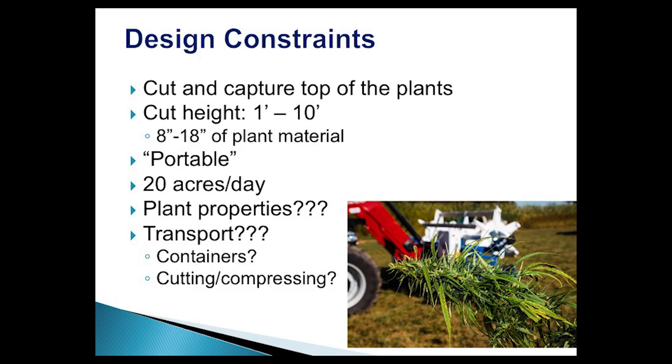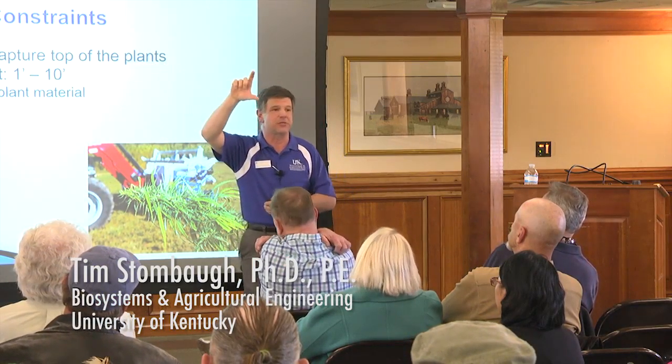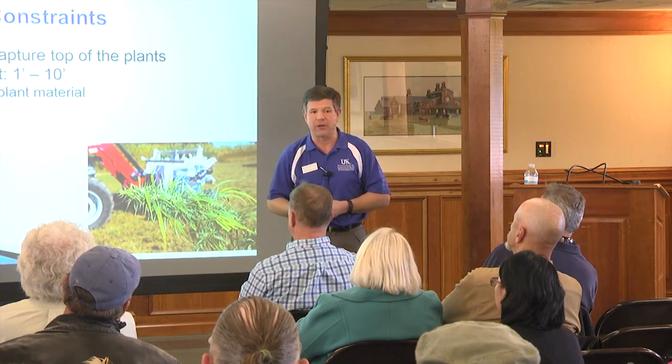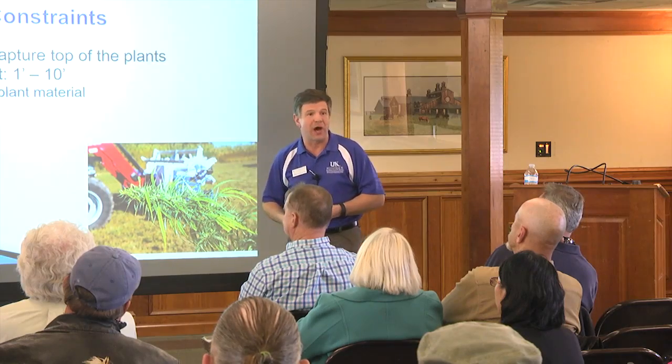If we could be 1 to 4 foot, or 1 to 3 foot, something like that, we could really use some traditional, conventional forage equipment. That wouldn't be hard to do. There's a lot of that out there. It's off the shelf. We could buy it, put it in the field, and away we go. We start getting 5, 6, 8 feet, and all we want is the top part of that plant. Now we need something unique. How do we lift the equipment up there to be able to capture that? And so that became the unique challenge for us, and it was kind of fun.